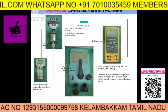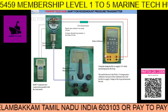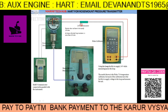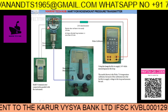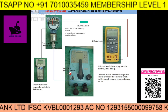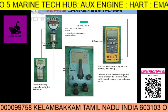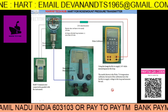This is the last slide. You can use the Fluke Calibrator here. You can see it is connected to the 24V supply and a 250 ohm resistance. This is the Rosemount pressure transmitter again. We are using the pressure calibrator pump to pump in the required pressure. The communicator here will communicate with the Rosemount, and all the details are shown here.